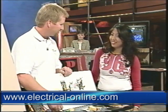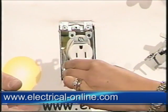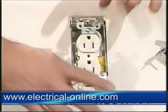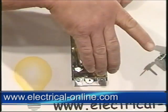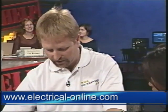It's always good practice to assume everything is hot, even though you've shut the breaker off and you're sure of it — assume it's hot. You should grab the receptacle by the tabs because they're grounded, so you won't get a shock from a grounded conductor. Pull the receptacle out and you'll notice the wiring connections.